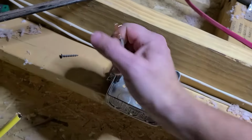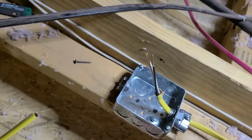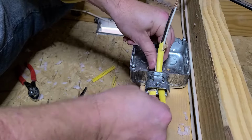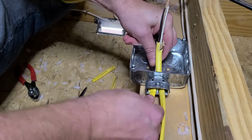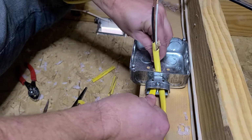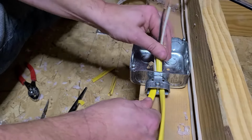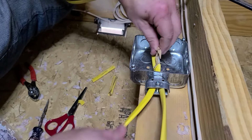The wire that I picked to get power from isn't ideal because it's not on the same breaker as the rest of the lights and outlets in that same room. But I needed a wire with enough slack so that after I cut it, I could pull it together inside the junction box and make all the connections. And this was the best fit for that.